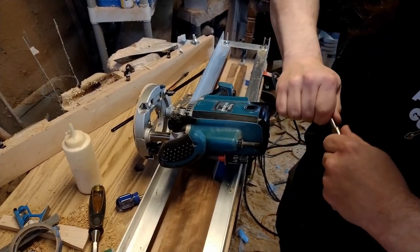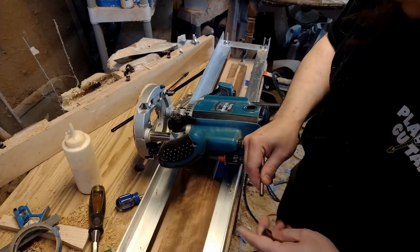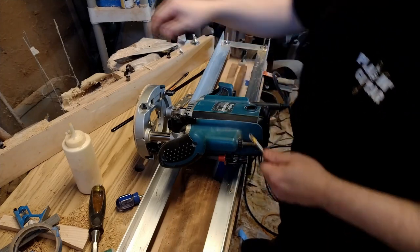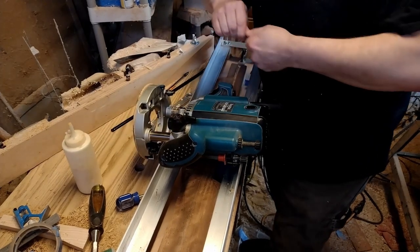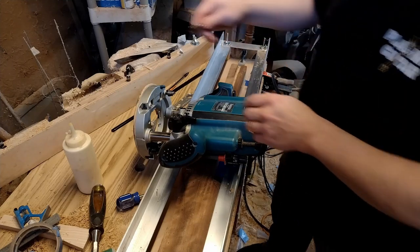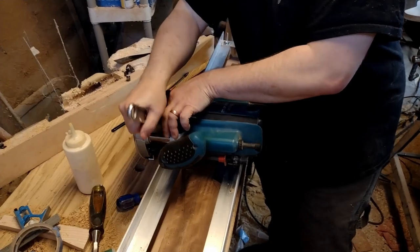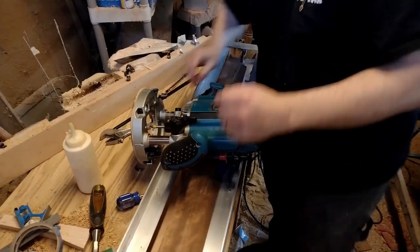I used to do this whole part without the neck taper in place — just a convenience to do it without, on the router table. It was pretty good but every once in a while it would not be pretty good. So this needs to be just a little more. Now all we're doing with that is going in the same approximate depth and a little less than the original channel. Oh holy smokes — that's almost perfect. I'm going to need to go just a little deeper in the primary channel. Down to that shelf and then back up just a hair.